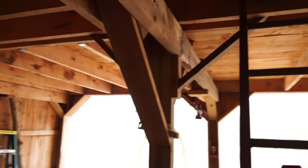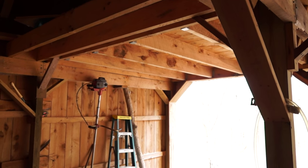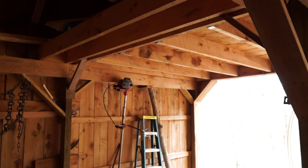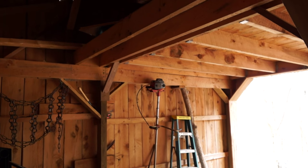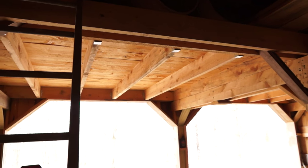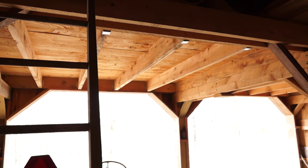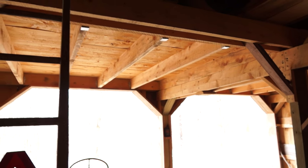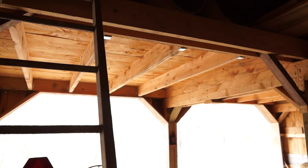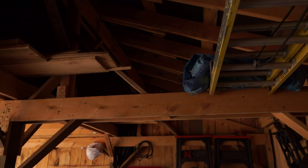I'm going to scan around here so you can see the framing involved. When I built it I had a couple of people comment on the build videos that they had seen barns like this go over in the wind. But based on the snow and wind we get here, I'm not too concerned about that. The upstairs loft is floored with 5-quarter-inch white pine, not hemlock. The framing is all hemlock. The white pine is lighter and supports what we need. All the floor joists are 2x8s, I think — if you go back to the build videos it would be more precise. We use the same 2x10s on the roof.